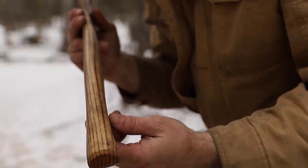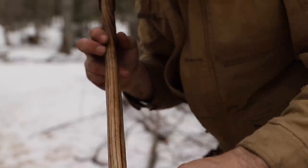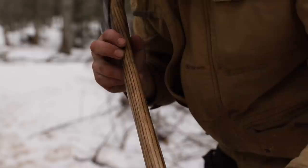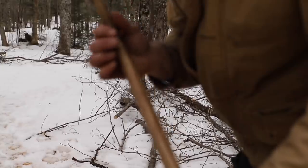You're looking for straight grain all the way through — you don't want it flaring off. You can see that grain falls all the way down and doesn't taper off. A lot of cheaper axes will have the grain taper off and get spliced off, so you end up with a lot of end grain all the way down the axe, and that's a weak point — a spot that can splinter.